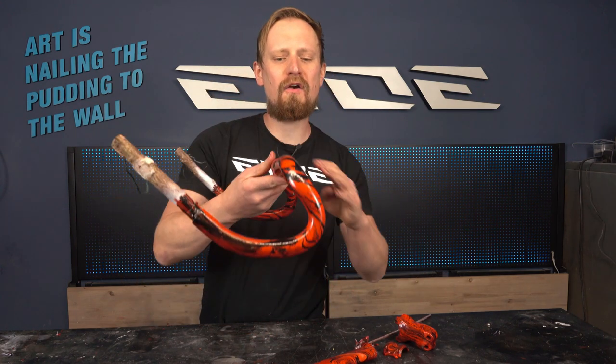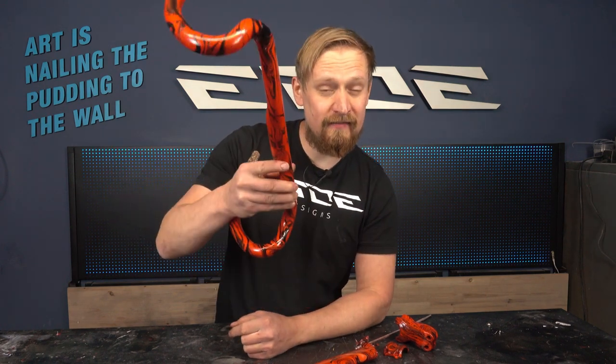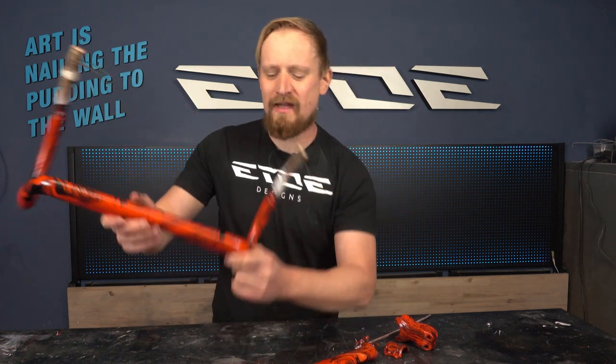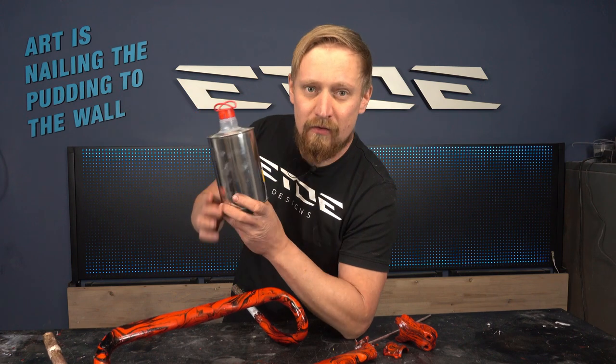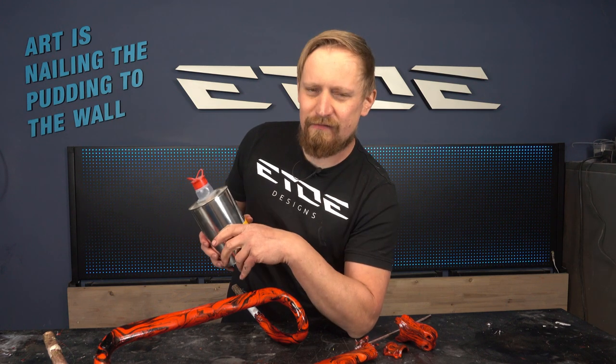What's not so cool is the surface — we have a rough surface with a lot of spots which need to be sanded. But if I sand now I will remove the structure and the color, and that's not what I want. If you know my videos, you know I like a professional finish, so we have to do two steps: a transparent primer, sanding in between, and the finishing clear coat on top. I'll use a transparent carbon primer because it's much thicker than a normal clear coat — it sticks much better and I can sand all these parts without removing any color. When the sanding is done I apply the finishing clear coat on top and I'm done.